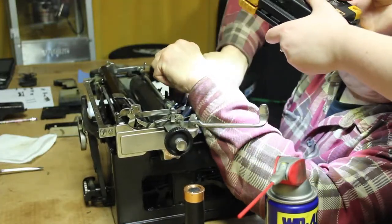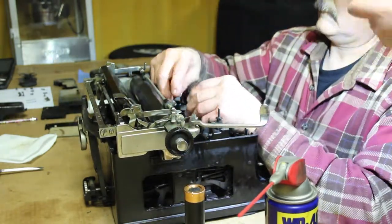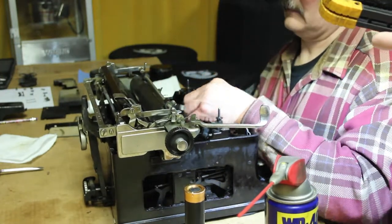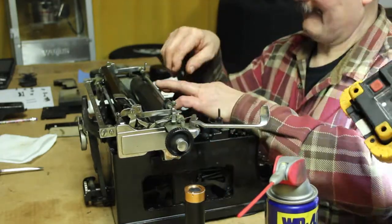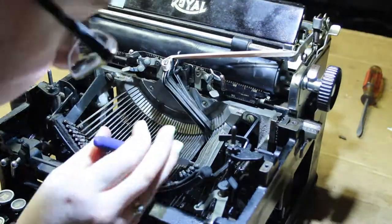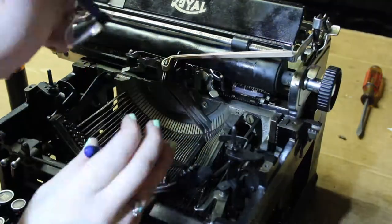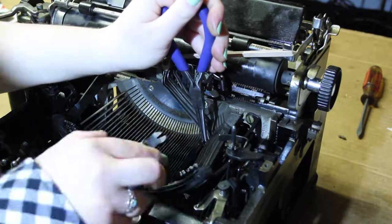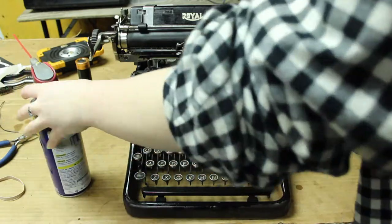We then took the typewriter inside and attempted to re-hook the X key and, using the S-shaped hooks, the zero and three. We had trouble fishing the hooks into some of the holes on the keys because they required us to bend the spring-loaded mechanisms. We found that the most effective way to get the hooks back on was to remove the wire holding all the keys in place for the key we needed to reattach, loop the hook back in, and then reposition the key. We did a quick WD-40 cleaning of all pieces and then let it rest.